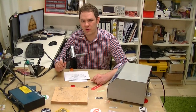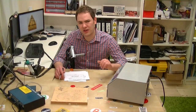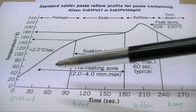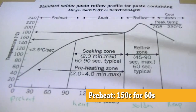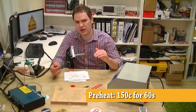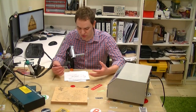The thing an oven does that's really cool is it follows a certain temperature profile. For each solder paste there's going to be a combination of temperatures and timings. Solder reflow profiles didn't make a lot of sense to me until I started using a reflow oven. Here's an example profile for simple tin-lead solder. The first phase is the preheat phase, where everything comes up to an initial temperature — here they're suggesting 150 degrees Celsius — so everything expands and there's less thermal stress on the components. Then you let it soak, which is for the fluxes to become active and the solder to begin to warm.